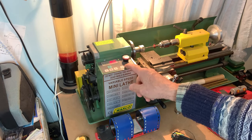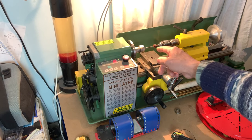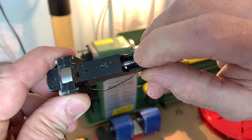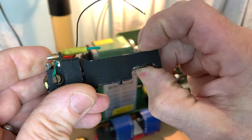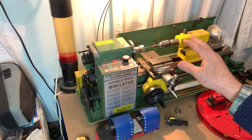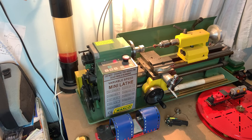Let me just turn the lathe off - you can see I've got an armature rotating there. A subscriber sent me a motor that they said wasn't running brilliantly, and I had to agree. I put it in my test chassis and it was running very badly. The first thing I found was that it was slightly bent in the shaft and end bearing. I think it had been put into a loco with the teeth sitting in the wrong position, so when the motor was tightened down there was a lot of pressure on the armature and it caused the bend. It was wobbling around all over the place, but I've got it nice and straight now.